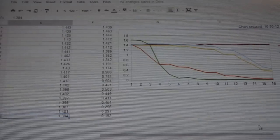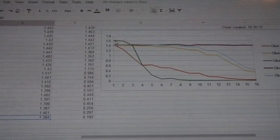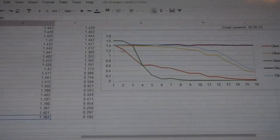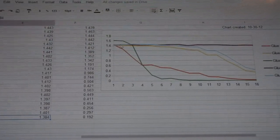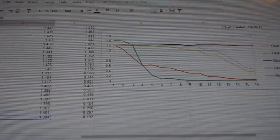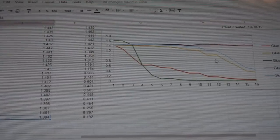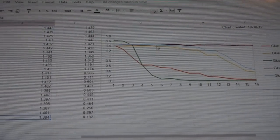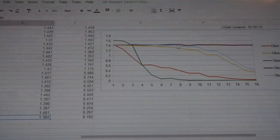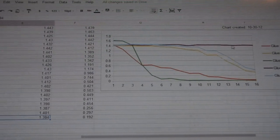Here's a chart that's probably better for people to see. The orange line is the glue-only cell — starts off and just decays. The green is the Epsom salt and glue cell — decays right off. The yellow is glue and salt substitute — decays right off. The blue is the table salt cell — also decays. And up here all by itself, the brown line is the crystal glue cell, which keeps on chugging along.